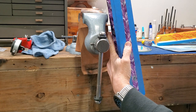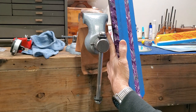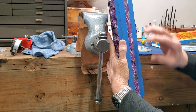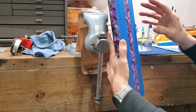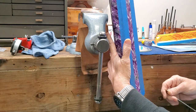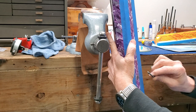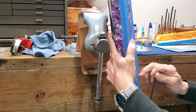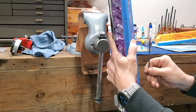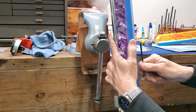100% agree, wherever you like to set it. 20 to 30 inch pounds. We've tested these at 30. I've tested them at 20, 25. Anyway, if you don't have the indicator and the apparatus set up to test like I just did, what they're telling you is it shouldn't be, another word a guy used was mushiness. It shouldn't be mushy. When you tighten this screw in right here, and it applies to both of them, when you tighten your screws in, it should set, pop hard right there.